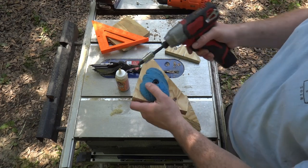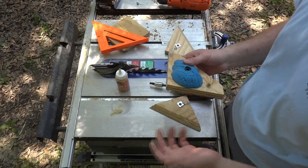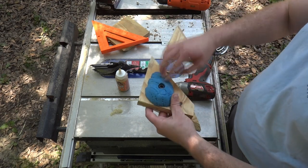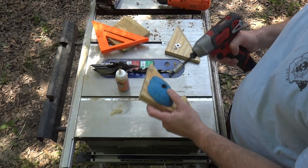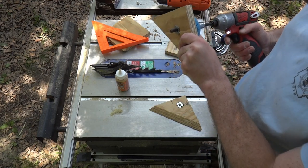So I'm using a hold, so I have a bunch of surface. If I did just washers, it would still impact into the wood and create some indentations in the wood I don't want. But with this larger surface I'm using for the hold, I can avoid that. So all I'm doing is setting that T-nut down in there, like so.